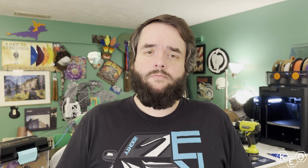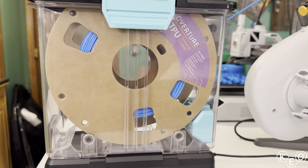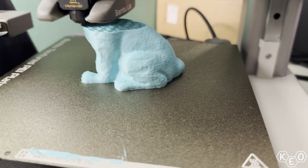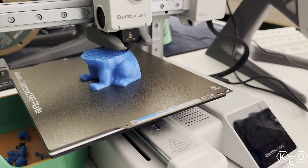A few weeks ago I decided to pick up some 90A durometer TPU from Polymaker — their Polyflex stuff, and it is flexy. I went down the rabbit hole having never used any TPU outside of standard 95A. For testing we're comparing nacho testers. My default profile uses gyroid infill at 15% density and three perimeters, changing one variable at a time. I printed one in 90A from Polymaker next to one in 95A from Overture, using generic 95A settings on Orca Slicer to see what happens.